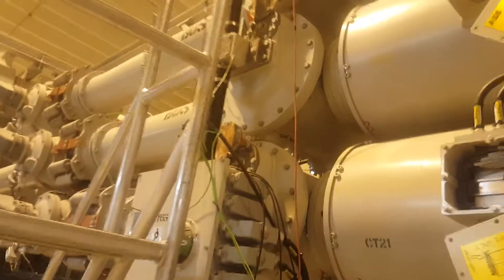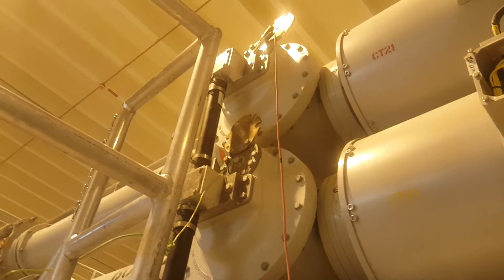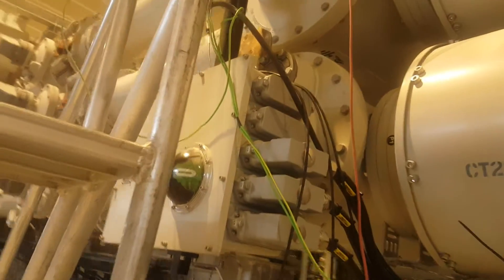Before performing the test and after the test, we have to take a megger reading for the insulation test — 5kV DC for one minute. We inject 5kV DC for one minute and check the insulation. It is coming in at about 2.4 tera-ohms. After the test it will increase more.